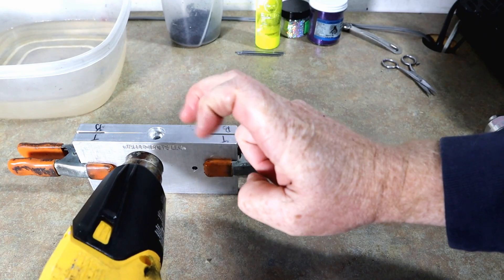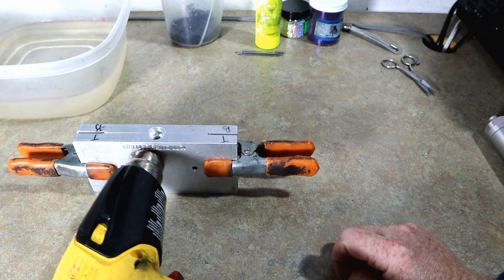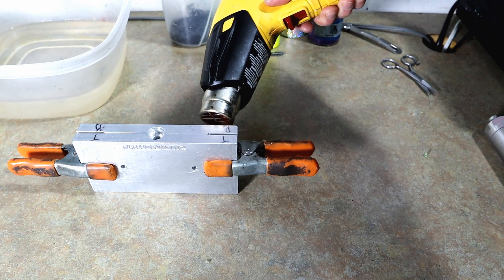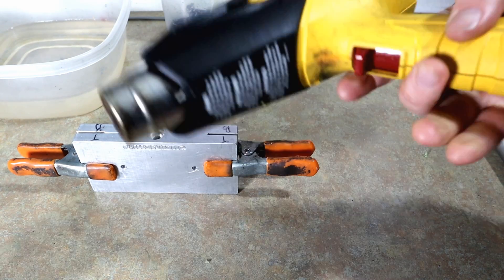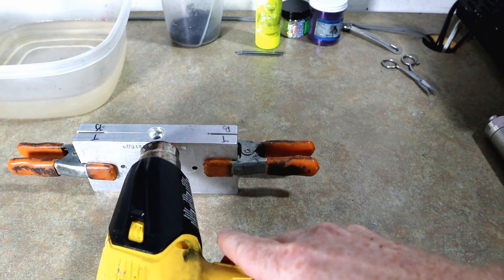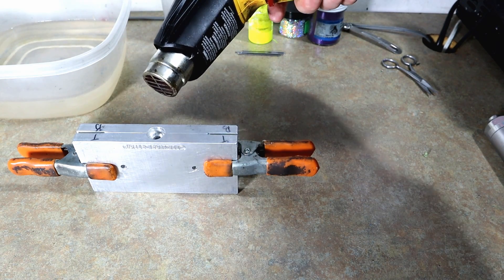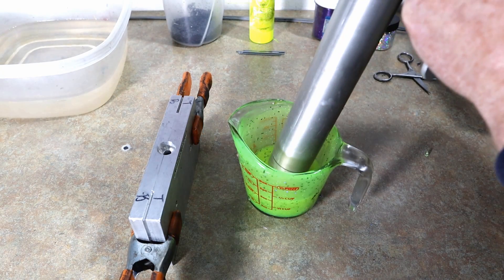Okay everybody, I am finally back and this mold has gotten a little cold. We're gonna take this heat gun and get the permafrost off of it. What you don't want to do, especially in a little core shot situation like this, is try to shoot a freezing cold mold — it's in the 40s out here. Getting heat into that mold helps the plastic so much. The plastic is hot, probably about 370 degrees, and here we go — shooting the core color, which I brightened up with more chartreuse.